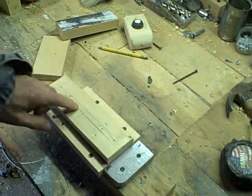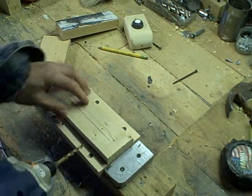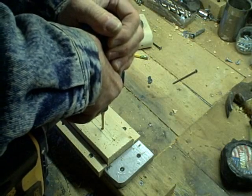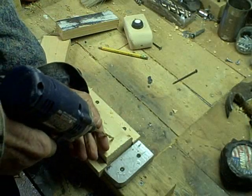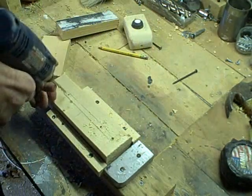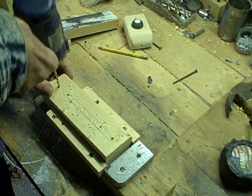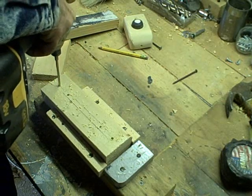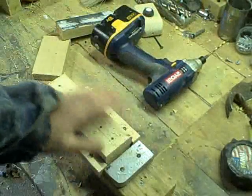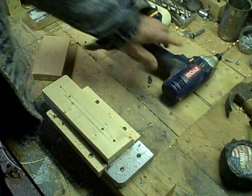This is the 2x3. Remember to put it in a holding jig before you start drilling, otherwise it's going to be bouncing all over the place. I like to make two at a time. These are the pilot holes, and we're going to be drilling larger holes right through them. I'm not giving you the actual distances between the holes — these are things you can figure out yourself, and it will vary depending on your design.